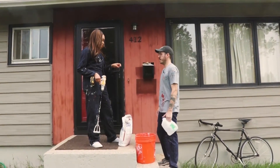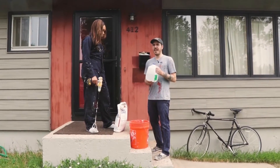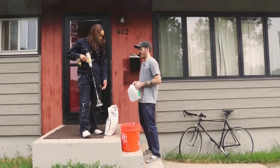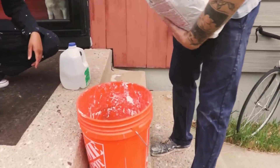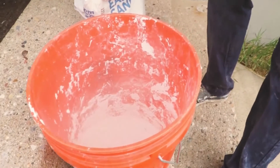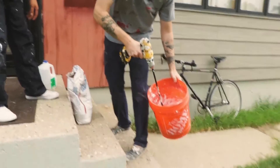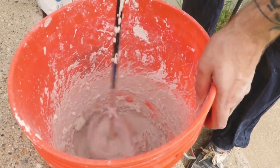So Caleb, we're outside and we're going to make the mud, as you call it. What does it actually consist of? Joint compound and water. That's it. This ain't for drinking, Carmel. We're going to be making some mud. And I get to use this cool tool to mix it up — the Ghostbusters tool, as you called it. So we're going to be dropping this in; we don't need much. I'm going to make this thicker than normal because we're going to be filling up those big cracks. I'll pour this in. Then you gauge it by doing this. This looks like it's going to work.